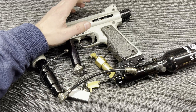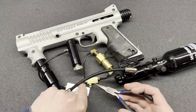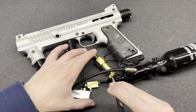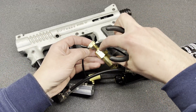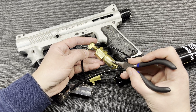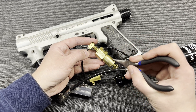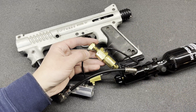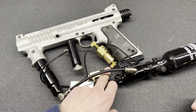To achieve a shorter pulse, I'm adding a flow control here. When air is supplied to the inlet, I'm also supplying air to the top side of this valve. Normally this would be closed off — the way these valves work is air comes in through the bottom, pushes a piston up which allows air through the outlet. The piston has a controlled leak through the middle: the diameter on the bottom is lower than on top, air leaks through, pressure equalizes, and the larger diameter piston on top pushes back down and shuts it off. By introducing controlled flow into the top, I can shorten the pulse.